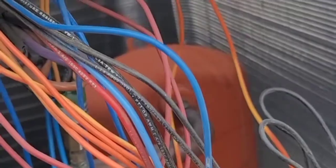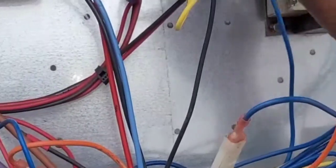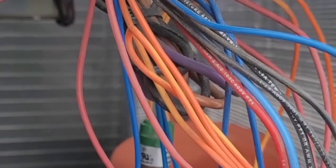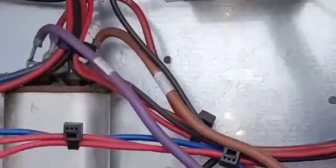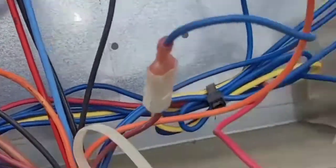I'll find one end of it, which was this blue one, and then the other end, which was this orange wire right here. Between these two, the low voltage circuit is running through my low pressure cutout, my high pressure cutout, and my pipe sensor. As it runs through that, it sends the 24 volts to my contactor and so on. But you've got to keep in mind — it's got to get the 24 volts from the thermostat.